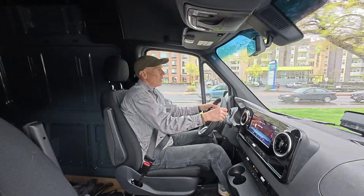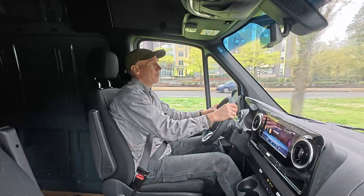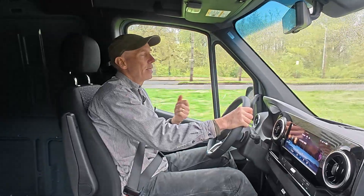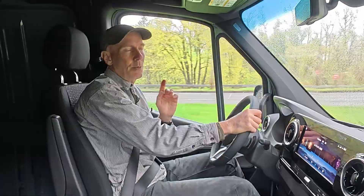Hello, welcome to Outbuilding. Today I'm using the van under a little bit of rain to head out and fill the concrete block with core material. And the core material — there's three choices for that: there's concrete, there's mortar mix, and there's grout. And I'm going to use grout, and I'll explain why in this video.